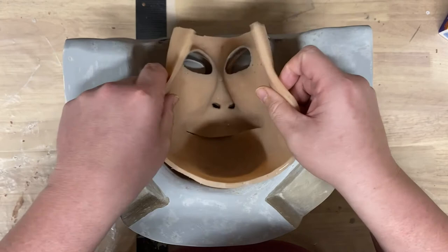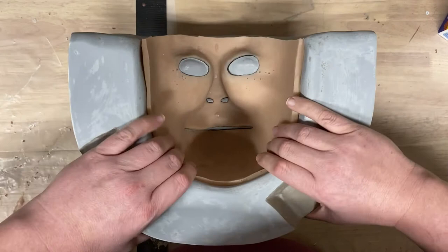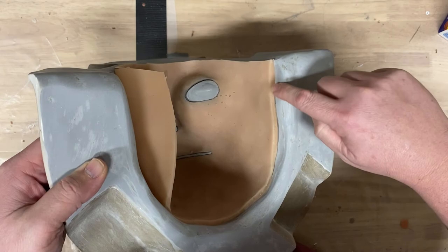So if you could imagine that this silicone face skin was actually clay, if it was not silicone and if it was a clay substance, then you could imagine that I would line this mold like so with clay. It's a little bit short on the edges, so I am actually going to go in and fill that, just this top edge all the way around with clay.